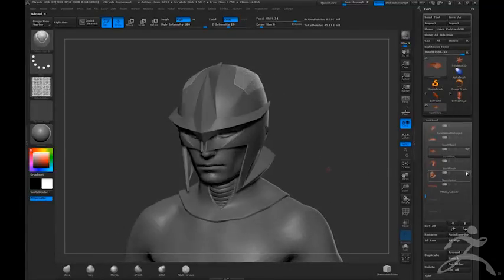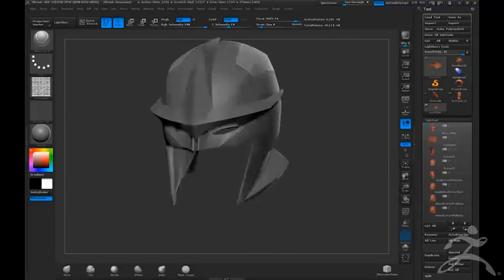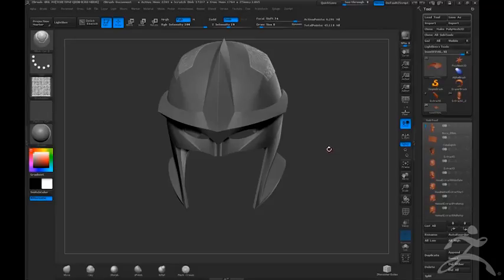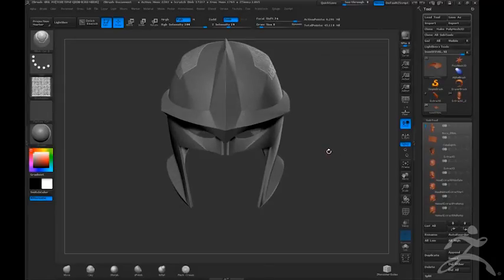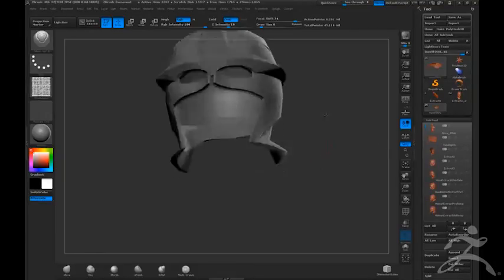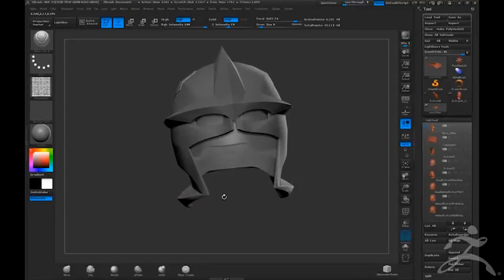So after this point, let's turn our neck gasket off. Let's go turn off Jason. And some parting thoughts on actually sending this to print. On large pieces like this, especially if you're going to be sending to a PolyJet based printer, also SLA printers, the parts will continue to cure even after they come off the print bed. So as these parts continue to cure, shapes that you see here where the parts are curved, these will want to continue to cure and pull inward.